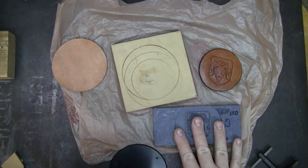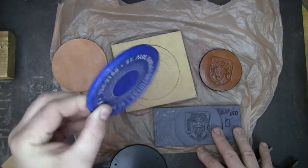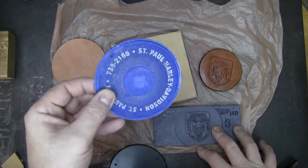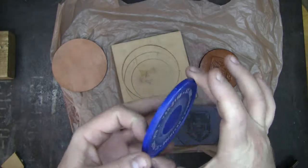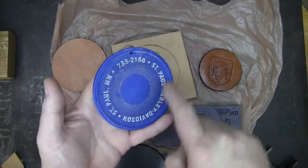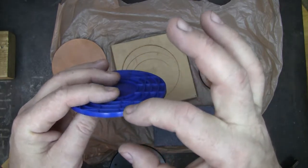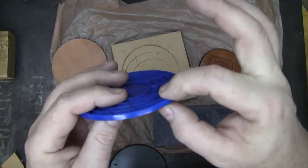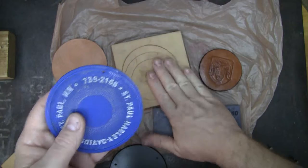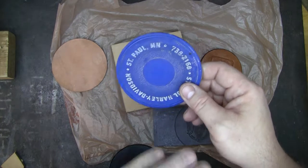I really like working with plastics and casting and molding. So what I'm going to try to do is machine out an original coaster, approximate dimensions of this. So this is 4 inches on the outside, and I'm going to put a lip in here. I've liked this one because it's been able to capture the humidity that gets in there. So what I need is a blank that's approximately 0.3 inches thick at minimum from flat, so that I don't cut into the wood, and so that there's enough space to mill it flat.